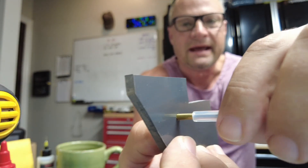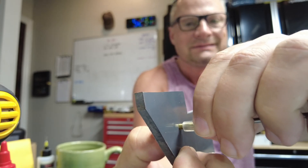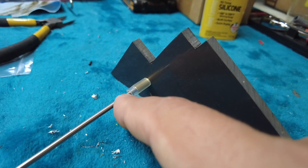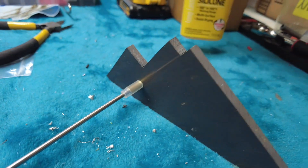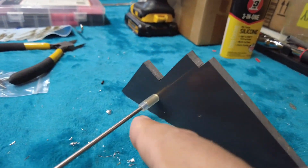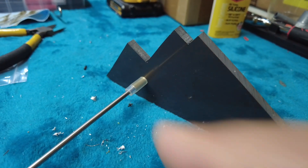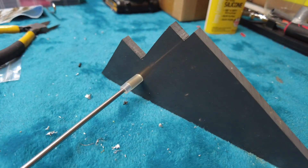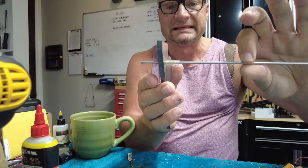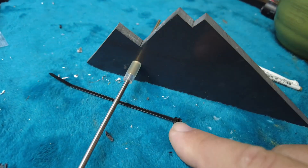We're going to insert the shaft and then slip that silicone tube over the sleeve. I'm going to put a few drops of silicone oil on here as lubrication because this piece is moving. If this was a wire or something stationary, you would not need this step. The oil just makes it a little easier to slip on and off, and this moves exceptionally freely.